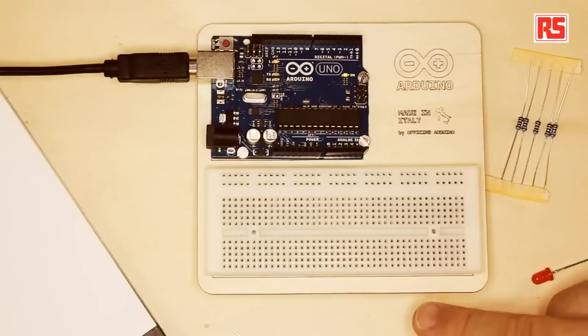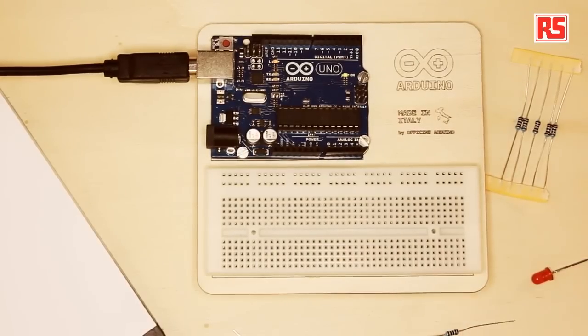How do we make the connection? What happens with circuits is that you can take wires and wrap them around to create circuits, but it's not very practical. If you want to do a lot of experimentation, if you want to move components around or try different kinds of circuits, wrapping wires is not the best idea. So we're going to use a component called a breadboard. The breadboard provides a set of pre-arranged connections, and each one of these holes is connected underneath with a metallic spring. When I plug a wire into the breadboard, the spring will hold onto the wire and connect it to all the other holes in the same line of holes.